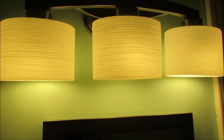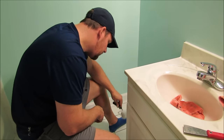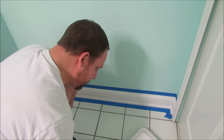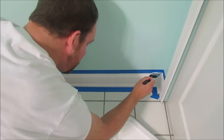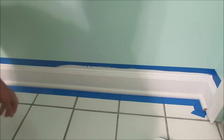Here's our installed light fixture — it's one of my favorite things and looks so much better than the old one hanging down. We kept the existing vanity because it was set into tile and I wasn't up for tile work. When painting baseboards, make sure the wall paint is completely dry before you start taping. As much as I like to think I can paint freehand, I do tape things off. It's important to get the corners really well and make sure the tape is tight against the wall, otherwise paint bleeds under and causes a mess.